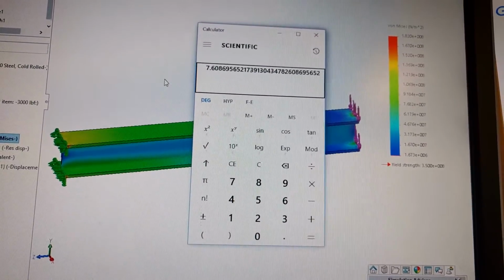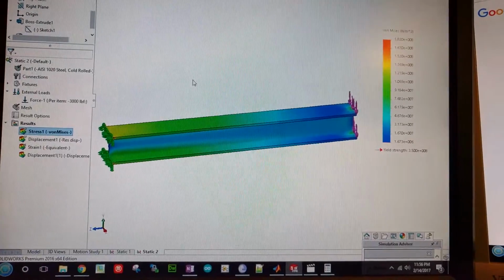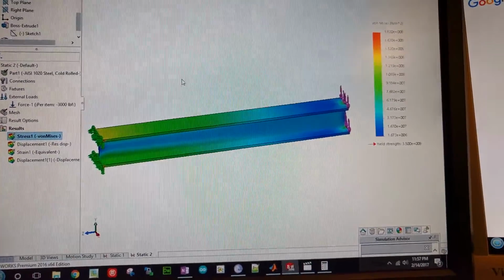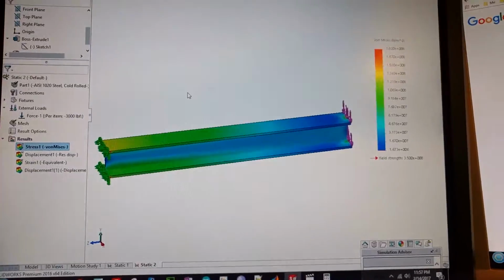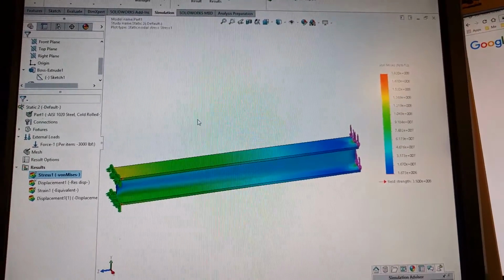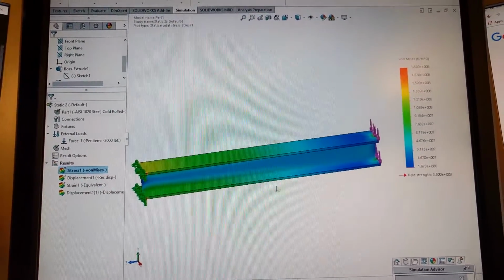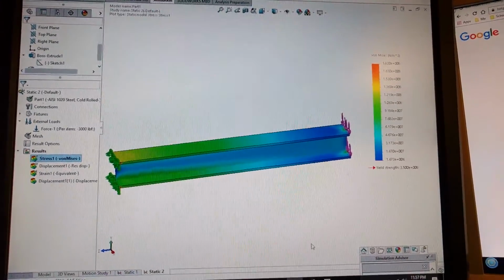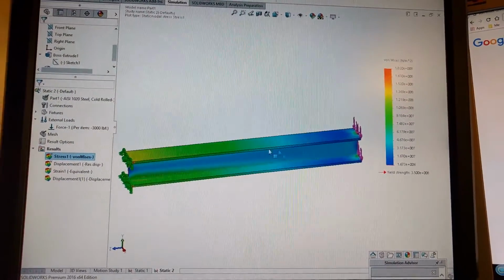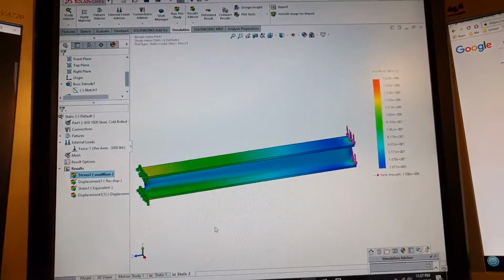But it sounds like you gave me some extra load in there when you gave me the constraints. You said that your tender was filled with water from a rogue wave, so it sounds like you gave me a weight that already had some extra mass thrown in there. But yeah, use your best judgment. You're definitely on the right path here if you get some good gussets going, and you exaggerated the weight of the tender. You said 3 tons is what we were using here for the 2 gussets. So it would be nice to increase the size of this I-beam, but if you get a good gusset out there on the top, something like that, it should be doable.